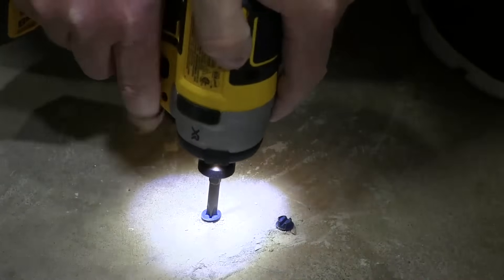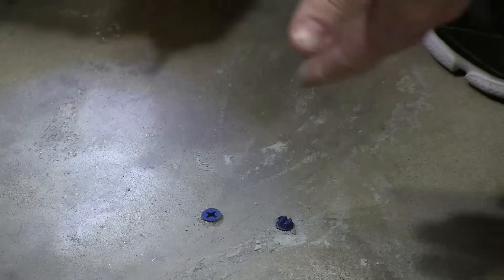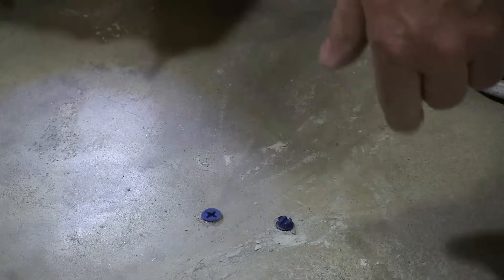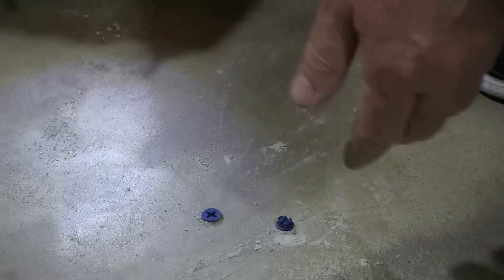Now I'm going to do a Phillips flat head — changing out the bit. What's key with a flat head is that with a quarter inch you have to have a number three tip. These are our Vega bits that we sell here and these bits are awesome — we have very little problems with these. You can see this fits in here very, very tight, and that is really what you need when you're driving in concrete screws. If I was putting a piece of wood to the concrete, it would pull right into the 2x4 or plywood and be flush.